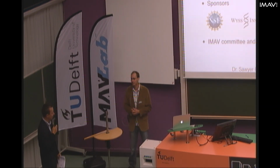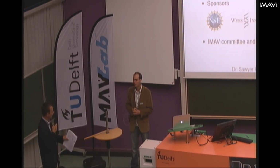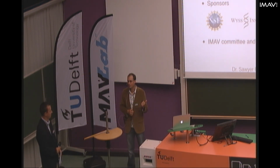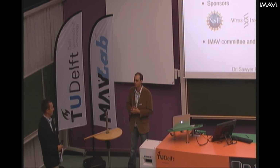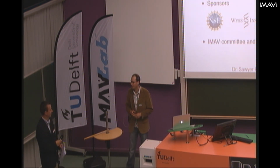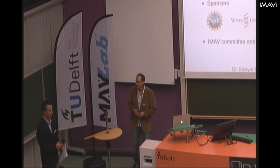May I ask a last question? Are you using sensor fusion between the gyroscopes and the motion capture already, or are they rather separated? In this study, there is no sensor fusion between motion capture and the gyros. That's what I've been working on now: making a Kalman filter is the next step, to do that sensor fusion. And that should give us no drift and reduced delay compared to the motion capture. Actually, I think the delay is about the same with a Kalman filter, but yeah.